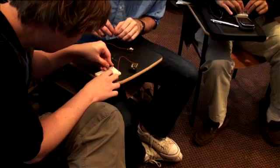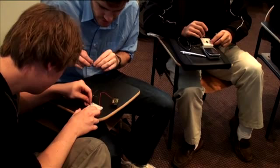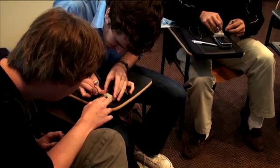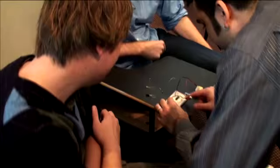You guys need a resistor to 1 and 2, a cap from 1 to ground. Is that 2? I think so. Okay. And then he's got sound. This one is in ground. Now this one is in 2. Yeah, exactly. There we go, we made sound. Alright, check for heat. Okay, wait for the photo resistor. Okay, ground, good. And then you got the resistor feeding back into the second pin.